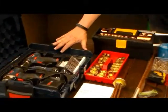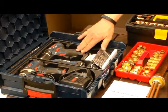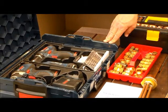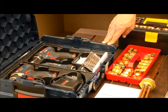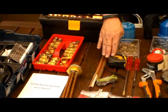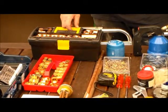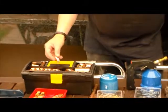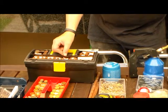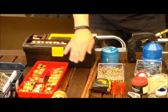I've got a battery driven set that includes a screwdriver and a driver, because we are going to take some roof screws out and put them back. For the piping, I've chosen to do copper piping — this is a quarter inch copper piping. That means I either have to solder, so here is a bunch of connectors, elbows, T-pieces and so forth that can be used for soldering the copper.